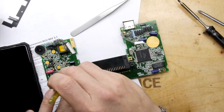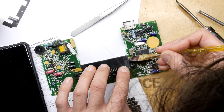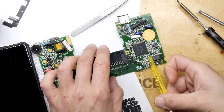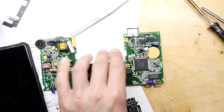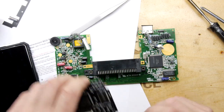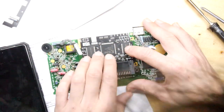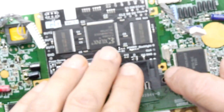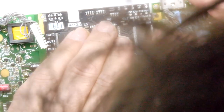According to the instructions it's time to slide the new board into place. There wasn't much to alter from the previous instructions - I've just plodded along, nothing too taxing, apart from a few resistors where I did a little solder bridge. If you're doing it yourself, you can just replace a solder bridge with a bit of wire. I believe this board goes on top here - there are holes to align it, but interestingly the hole down here doesn't quite align. I'm nervous about that but I think we'll just go with it since the top holes do align, and you just add a blob of solder to fix it.